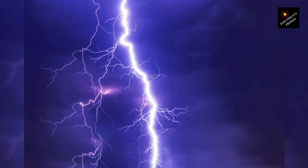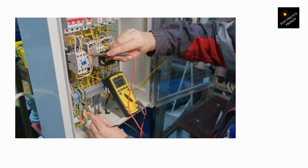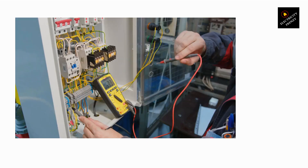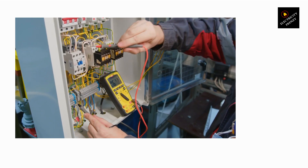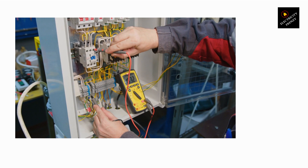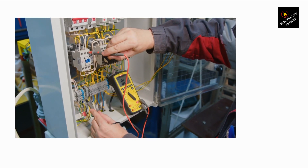This is because the voltage and the wire thickness determine the resistance and impedance of the windings. A higher voltage motor needs more turns of thinner wire to achieve the required impedance, while a lower voltage motor needs fewer turns of thicker wire. When you connect a 220 volts motor to a 110 volts outlet, the motor will not operate correctly, and there is a high risk of damage, as the motor is specifically designed to handle the voltage and current it was built for.